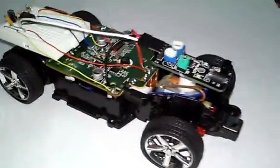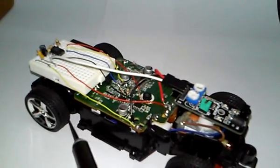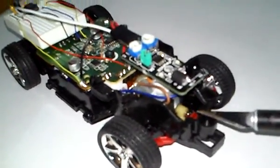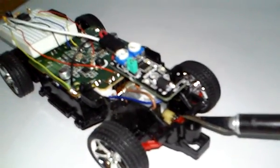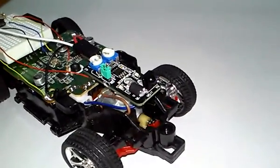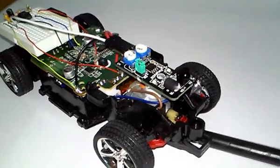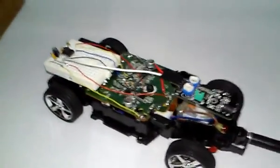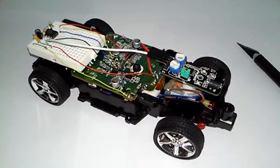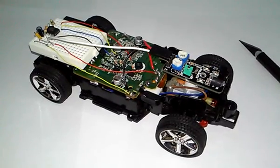No modifications were made to the drive motors. Inside here is the gear train which drives the rear wheels, and up front is very unsophisticated slam steering — that's the DC motor which slams one way to turn the front wheels left or right. Underneath there is a small adjustment which allows you to tweak the steering to make it go more or less straight in the neutral position. That's it — a fun project, and hopefully you may consider building a Robocar of your own.